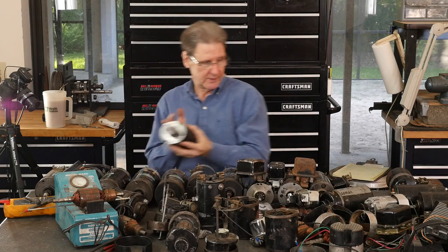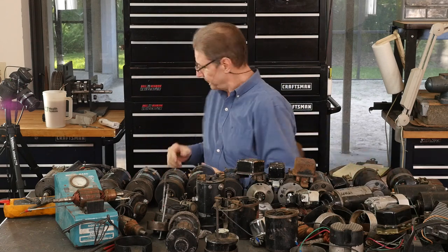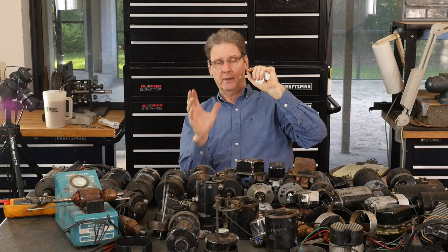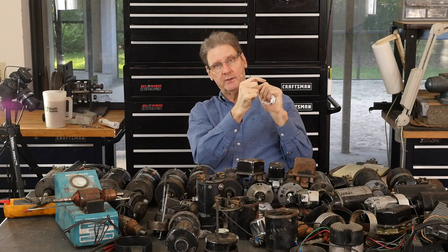It was my only transportation for a while, my 77 Sportster. So it took years to figure it out. It was nothing with the generator or the voltage regulator. Somebody put 16-inch tires on the back, and they're wider, and there's that wire that goes to the taillight brake lamp that when you push down on the back of the bike, the edge of that tire was rubbing those wires raw and shorting them to ground.